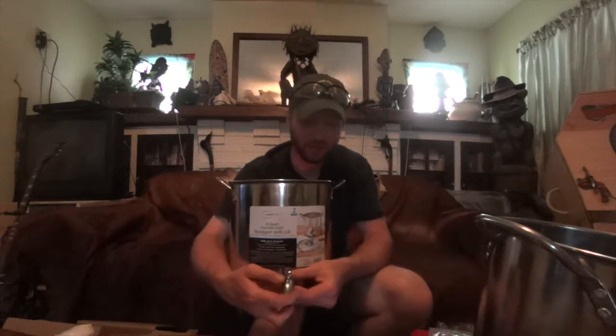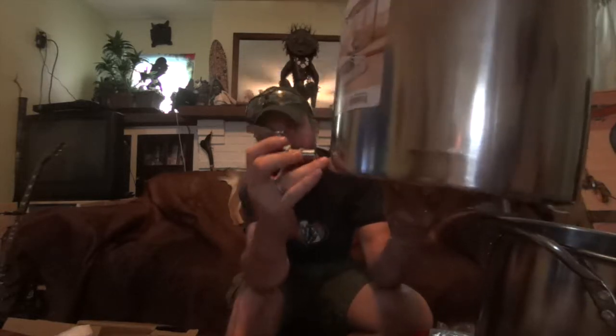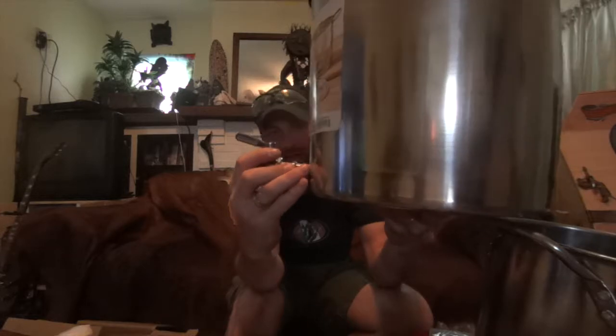So I'm going to take the diameter of this and come up to about where I want it, which is going to be about 1/2 inch off the bottom. And since I've got a dent right here, I'm probably going to go centered at least 1/2 inch up, maybe just a hair more to get into the face. Once you've got that, a round file will soften up any burrs you have. However, these cut extremely well.